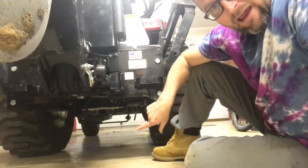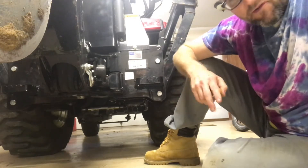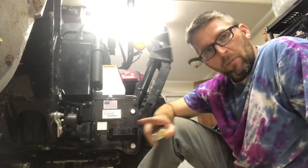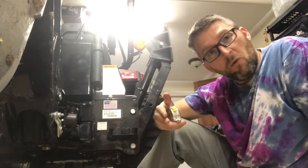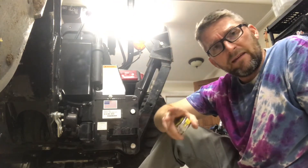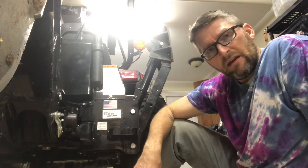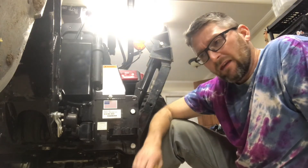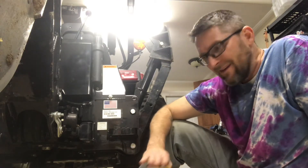So thinking about the 13 and a half inches I've got to make up for: the wheels account for seven and a half inches from the bottom of the wheel to the swivel plate. So there's seven and a half. My 4x6 — I'm using the 4-inch side — so there's three and a half. That brings me to 11. Then I've got a 2x10, and I'm going to use the inch and a half side of that, so that brings me to 12 and a half. I'm about three-quarters of an inch shy of 13 and a half, which is a good safe place to be.